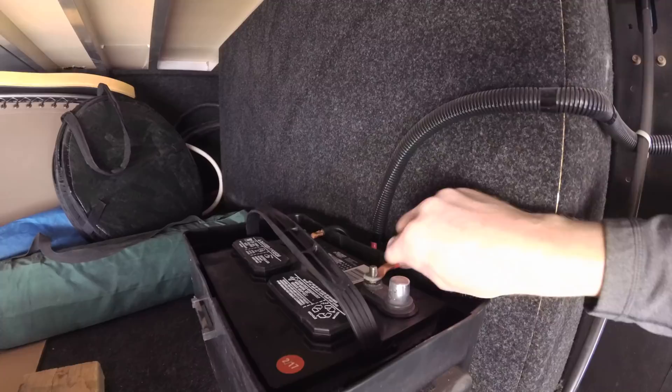It's still saying that we're not getting any propane. What I think is it's coming in here, getting down here, but the igniter's not catching. So I'm going to take this apart and check that out and clean it off.